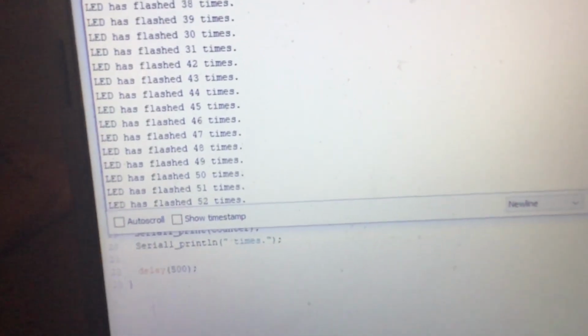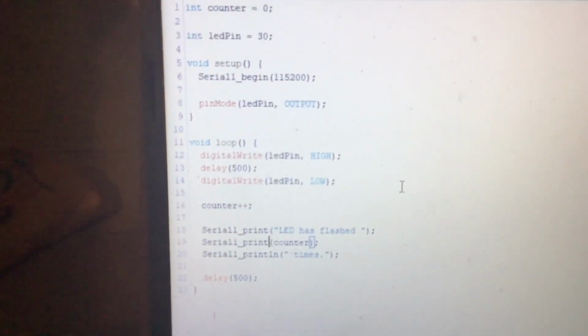So you can't print integers out with this without it glitching. Text works fine, but integers, no. They're glitchy. There is a specialized function designed for integer numbers. You just gotta take this right here and put an underscore and the letter I right there to turn it into a specific function. But I have tested that. It doesn't make a difference with the bug that's suddenly adding the number 10. This package is still a work in progress, so it's not gonna be perfect. But I think they will eventually fix it soon. But it does work very well.